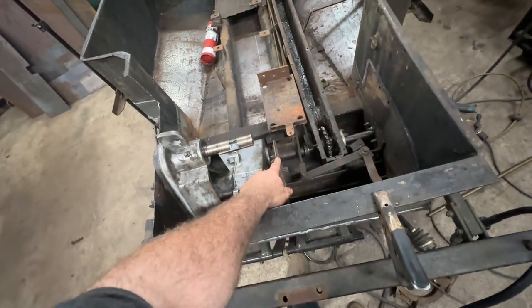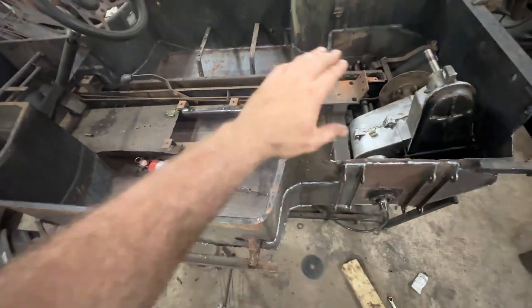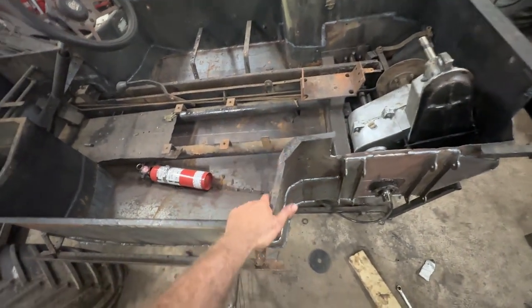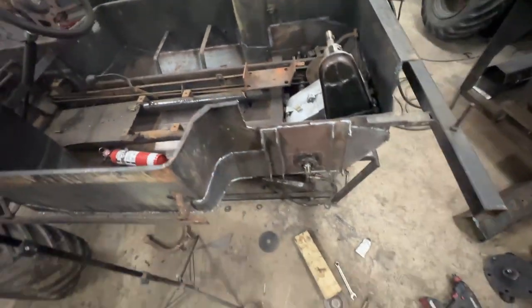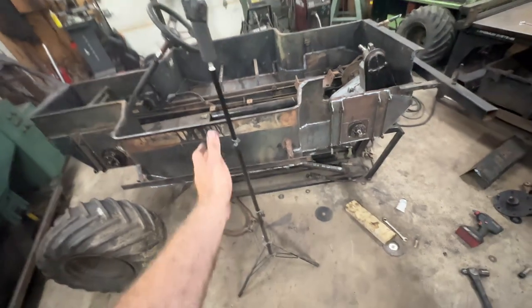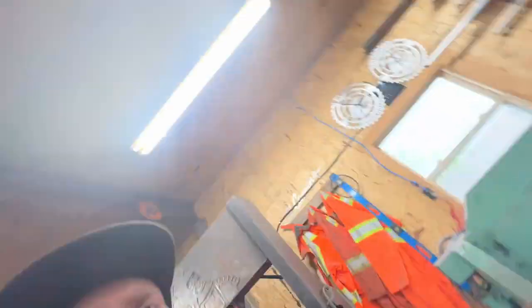I am going to do a hydraulic disc conversion on this thing. This head comes back and it's essentially just a rod — like a mechanical brake caliper — and that would probably be fine in stock form, but the motor I have for this is quite a bit spicier than what was in it. We've got tons of things to do. I know it looks bad to put it together without painting things, but it's probably coming apart again — I have to put a fuel cell here somewhere, a battery tray, motor mounts need to be made, exhaust hangers need to be made. There's no real sense in painting it if I've got to grind it all off again, so we're going to mark it all up, probably drive it for a bit like that, and then we'll go to town and make it pretty. But yeah, I'm going to call it done on this one — if you like this stuff, like and subscribe, it helps out huge. Thanks for tuning in — I really appreciate it, and I'll see you on the next one.